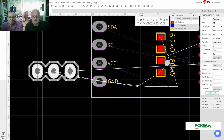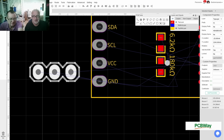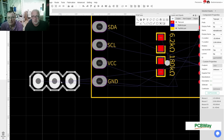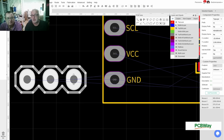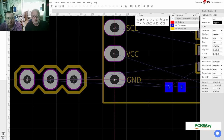So this should maybe be in the middle here, and pop two resistors over there. The nose needs to go low down, otherwise it won't fit on the board, and avoiding the banana plug. So it needs to go down. I'm thinking if the two resistors can go above. Well, I have a second side here, so I can do the ground routing on the bottom layer. Wire, and this will be a ground fill anyways.